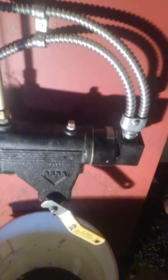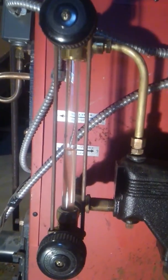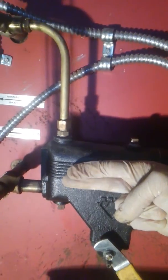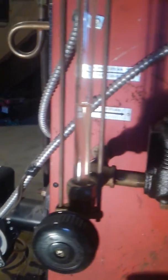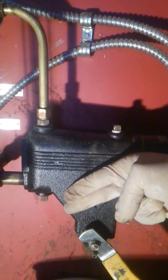I'm making this video to explain the role of this low water cutoff. This is a manual low water cutoff — what it does is control a safe water level in your boiler. This is a Smith cast iron boiler. Inside the low water cutoff there's a float switch that extends about five or six inches. When the safe water level drops, the float switch — which is inside here — also drops, which cuts the power to your burner so the burner doesn't start.